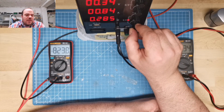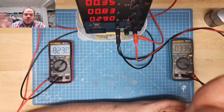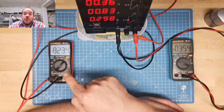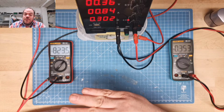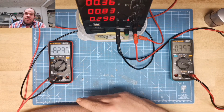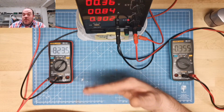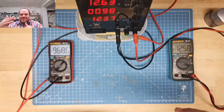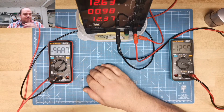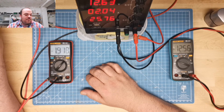I set the constant current to 1 amp and it can bring it now, and so the voltage drops down because the electronic load wants 1 amp, and it just turned down the internal resistance, so the power supply voltage drops because I set the constant current too low, down to 1 amp, or lower than 1 amp, and so the voltage drops to 0. That's also normal. It's like everything goes together. Just set this higher. So I tell this guy can do 50 watts. That's totally the limit.